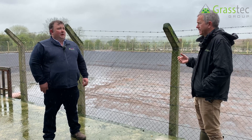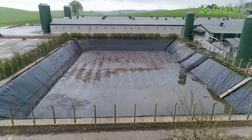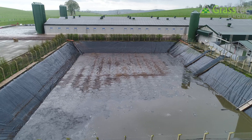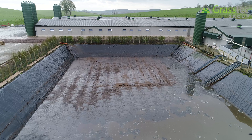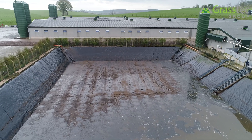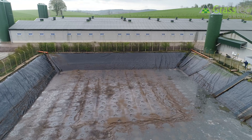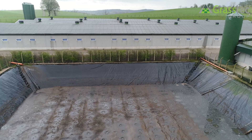So this is a pig farm, just to give people context? Yes. And there were issues around the consistency? Yes — he was mixing it with a propeller mixer because it separates out so quick. By the time the lagoon is empty it has separated again, defeating the purpose. But the bubbler system with the control panel — we can switch from automatic to manual and have it running consistently all day whilst he's pumping out. Ideally he uses most of it himself and then there's people coming and taking it away as well, so they can come any time, take a load of slurry, and it's ready to go.